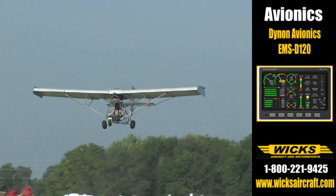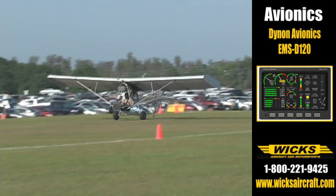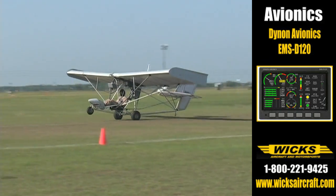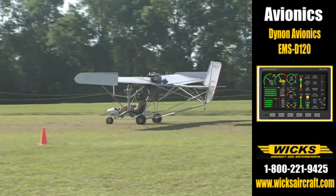She was a little out of balance and we wanted to put a bigger motor on there, so we went and got the HKS 700 turbo. That's the 80 horsepower — 80 horsepower for about two minutes, but then it's 77 horsepower continuous after that to 16,000 feet. So that's quite a bit of power to have on a little M-squared.